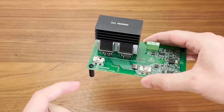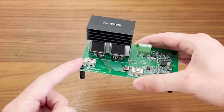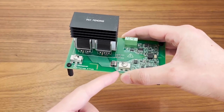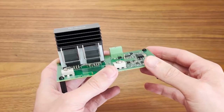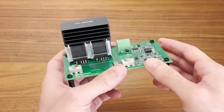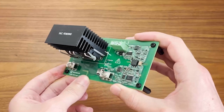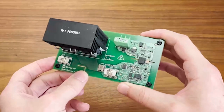Current flows from a high-voltage battery into the input terminal, then into the drain of the MOSFET. The source of the MOSFET sends it through the current sensing resistor, which checks for overcurrent events, and then out through the terminal that connects to the high-voltage load. Silicon carbide MOSFETs also have faster switching frequencies relative to silicon MOSFETs and IGBTs, and this translates into a faster response time — meaning the fuse or circuit breaker can shut down very high currents and even short circuits before overloading a system. So instead of cutting off current at thousands of amps, which puts a lot of stress on the system, the wiring, and the load, you can cut things off at hundreds of amps instead.